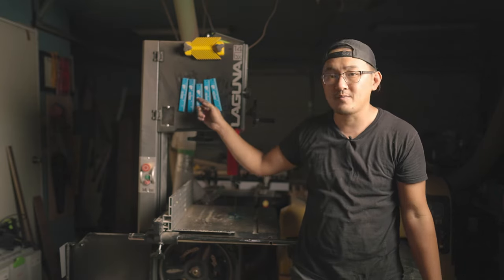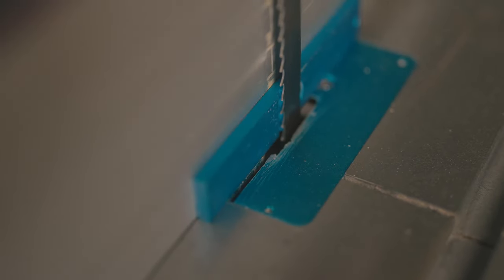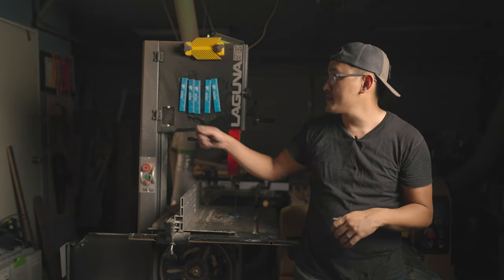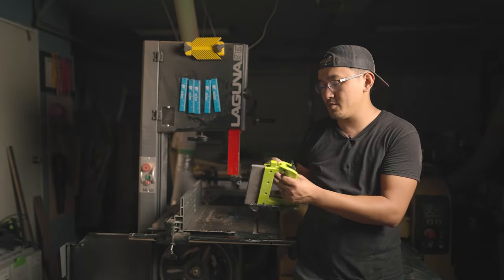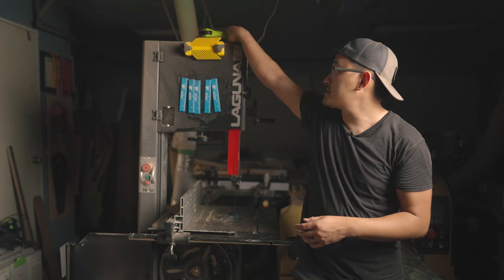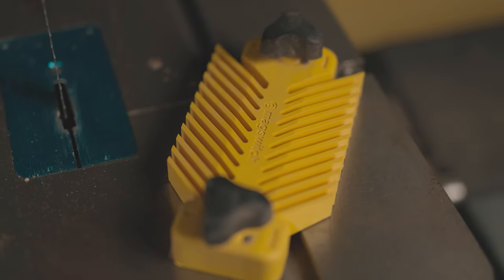One is this from Carter Products — these are just reference guides you stick up against your blade and it sets the fence to the right thickness when you're resawing. Definitely great to have a set of these; they stick magnetically onto the case. And then there's this thing here — it works similar to a featherboard where it pushes the piece up against the fence, so whenever I go to resaw, this is usually on there to help guide the piece through. For thinner pieces, I'll use this mag switch, which also sticks magnetically right up here.